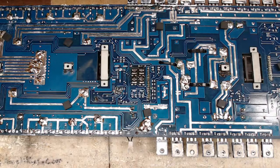Oh, guess what I have back? I have that US Amps AX, what was that thing, a 4600? The output capacitors right after the inductors, all four of them failed. I mean, literally tragically exploded. I have no real cause of how that happened, but he hooked it up. He said it was just playing as hard as can be, and then the capacitors failed. So I'm not sure, but I see you had mentioned the US Amps EX, the DE. Well, yeah, I've got a DE in also that I'm trying to find new capacitors for.